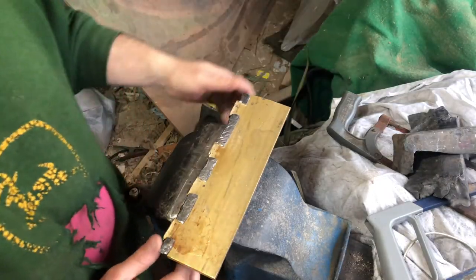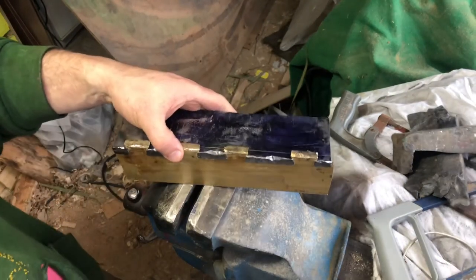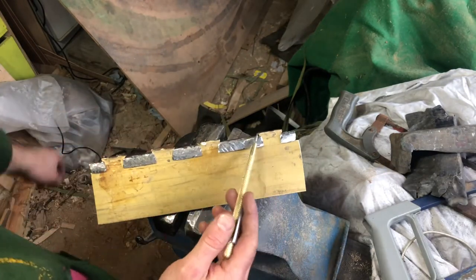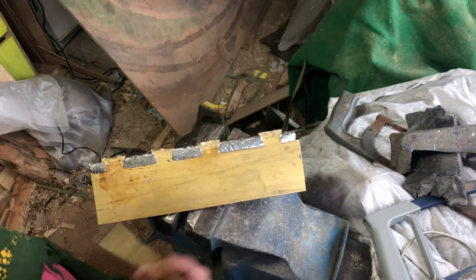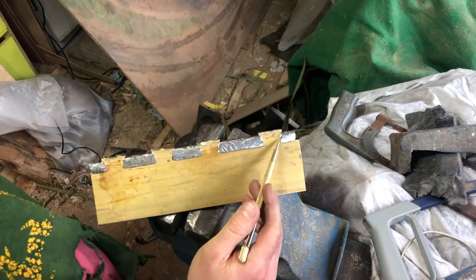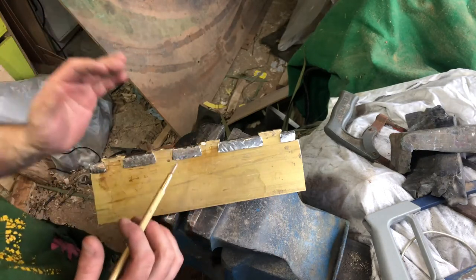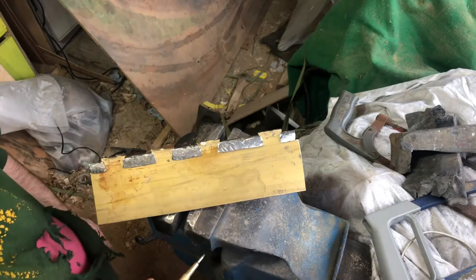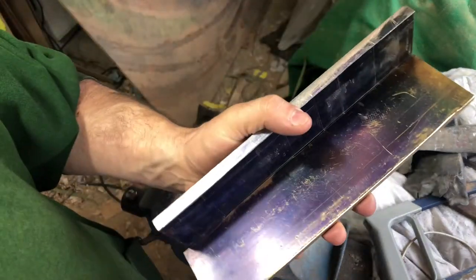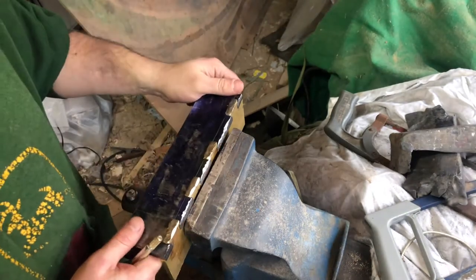Wow, that takes a lot of hammering. And it looks really rough now as well, which is a shame, because I put a lot of work into it, and then you've just got to trash it a little bit. So, like, you knock all these in, you peen it over, and any sort of imperfection between the mating surfaces of your cheek and sole plate, base plate, whatever it's called, the metal expands into that. There's no glue or Loctite or anything in there. On the inside there are some gaps, but on the whole we look pretty good. Oh, frig me, that's warm.